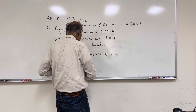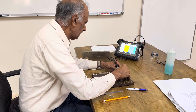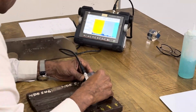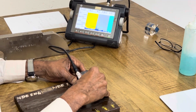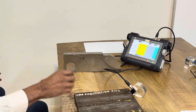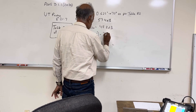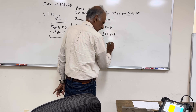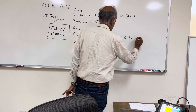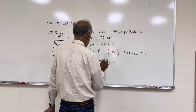The third value is the attenuation factor C, which is based on the sound path. I check the SA value and the SA value is 1.8 — so 1.8 is my sound path. The calculation is 2 times 1.8 minus 1, which gives 2 times 0.8, and that equals 1.6. So C equals 1.6.